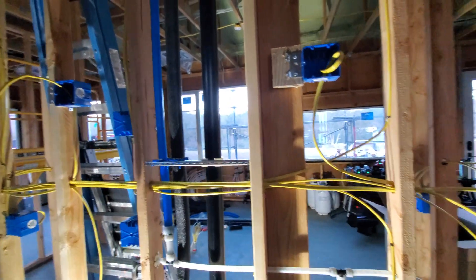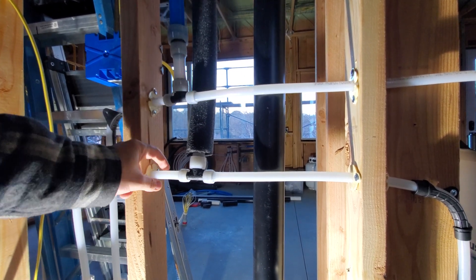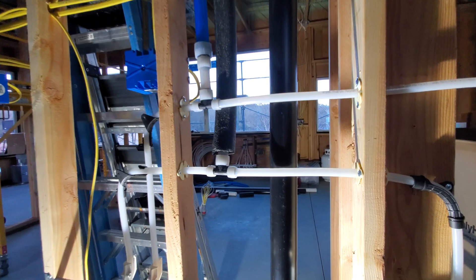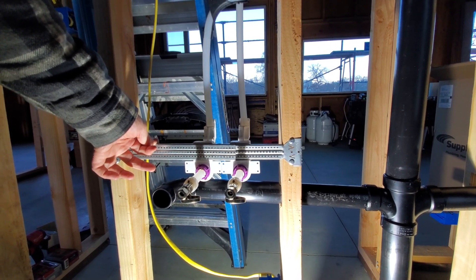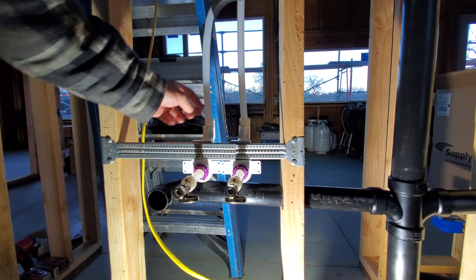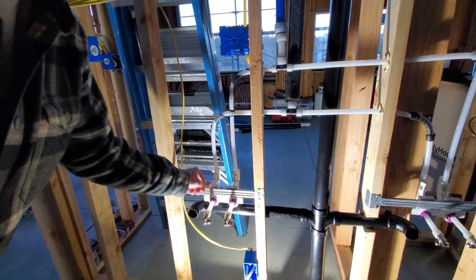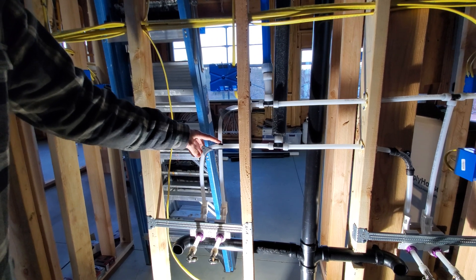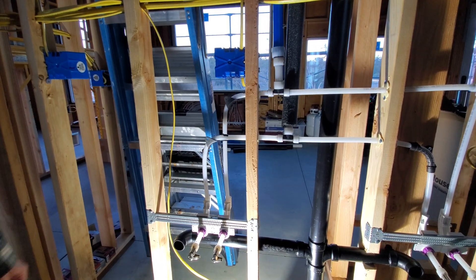There are also little grommets — you drill a hole through a stud, put this grommet around the pipe, stuff it in the hole, and screw it to hold the pipe steady and protected from the wood. There are hold-rite brackets as well, though they're a bit difficult to thread the pipe through. For bends, we used plastic bend supports: PEX can be bent as long as you don't exceed its bend radius, so rather than a 90-degree fitting with two fittings on each side, this just lets the pipe bend smoothly.